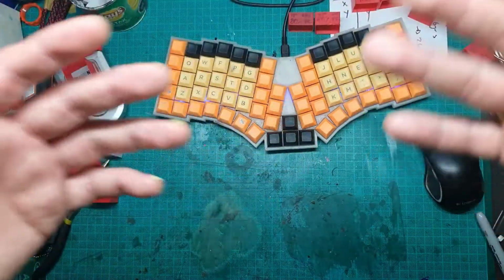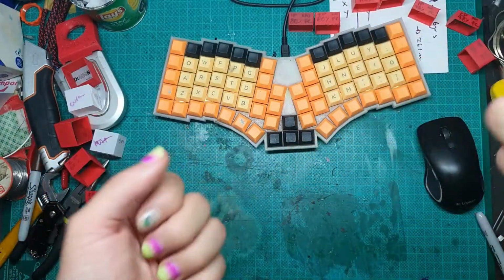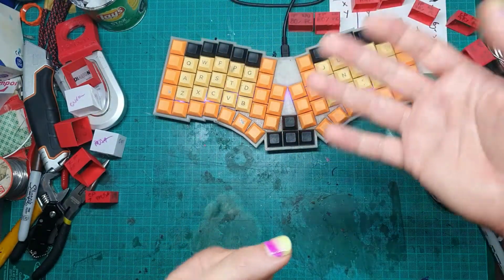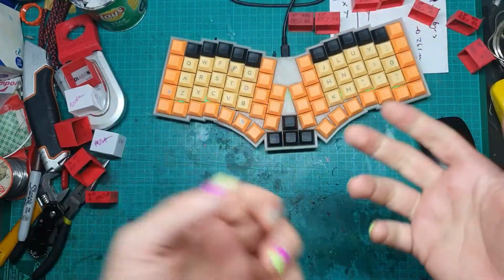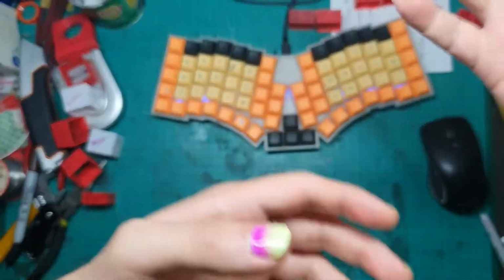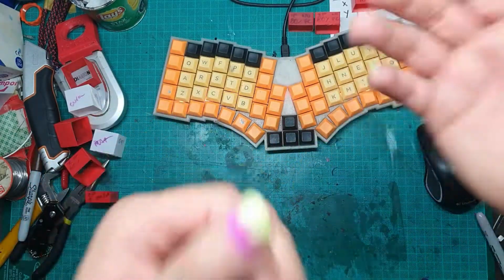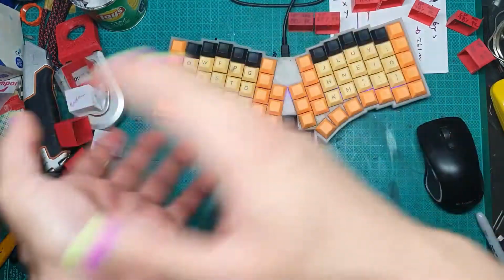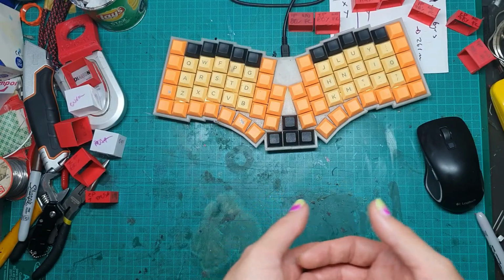How I figured out that this is actually doing this is I went and looked at the G code, and I confirmed that yes, the Cura generated G code is actually over extruding in some parts and under extruding on other parts. And when I turned this setting off, the numbers on the G code were much closer to the ones on the G code generated by Prusa Slicer.